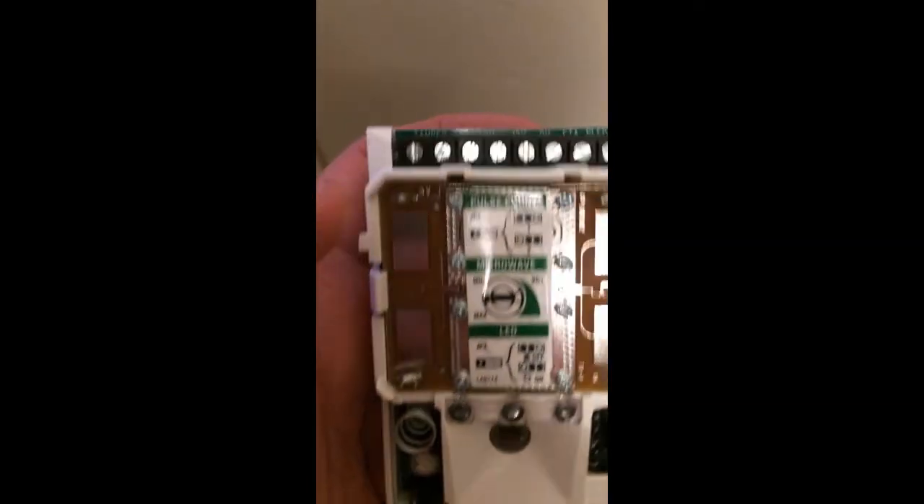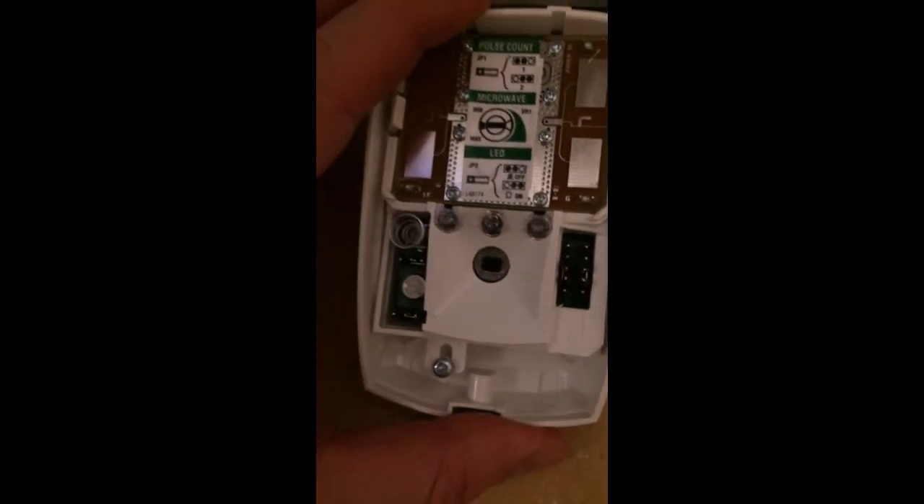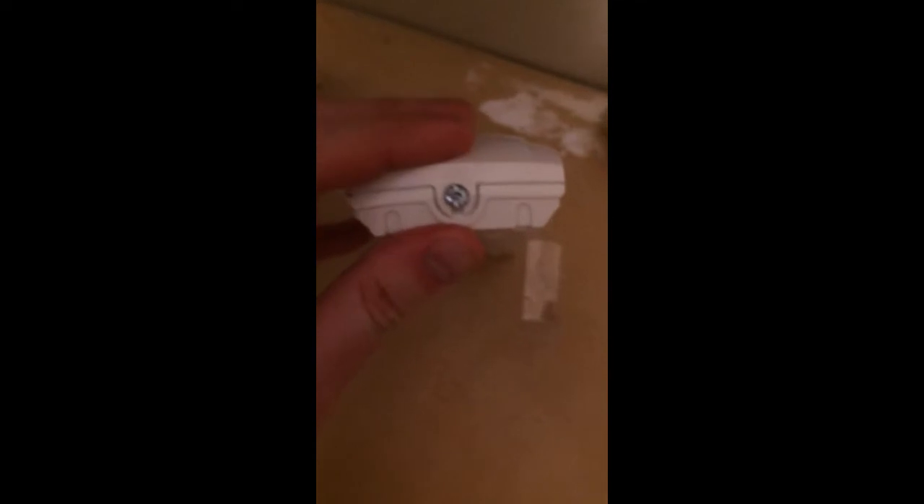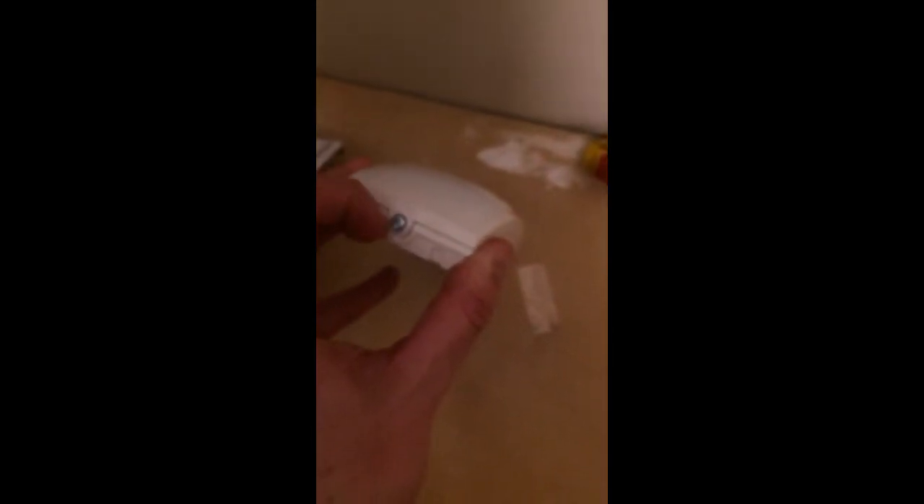What we'd then do is seat this into your bracket, which is like this — you've got little grooves down the sides. When you see this little screw down below, just pop that in like that and you can pull it forward and it won't budge. With these clips, they go in at the top and then you just squash them together using some force on the bottom. You will hear it click, then click, and then you do this bottom screw up. If you lose this bottom screw, because they have got that click action I wouldn't worry too much, but it is better to have it in just in case someone wants to knock it — you don't want everything to fall apart.